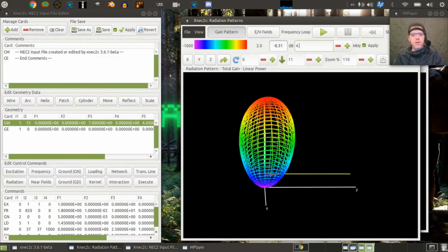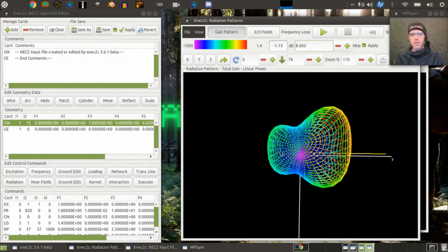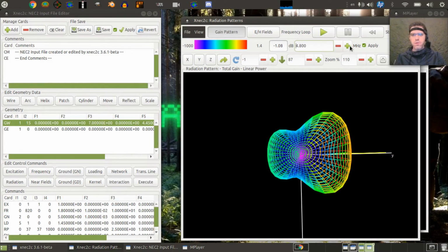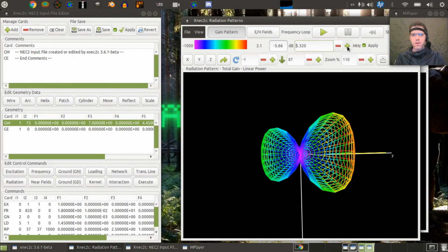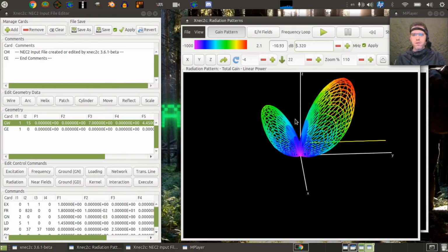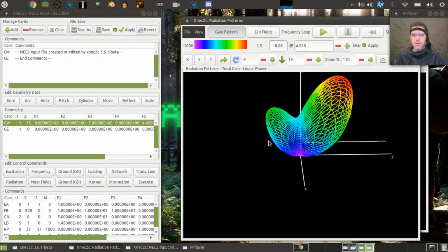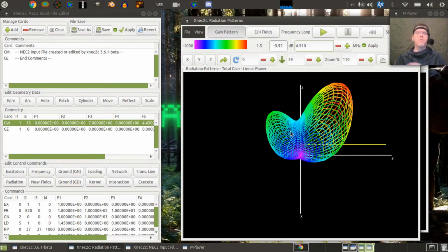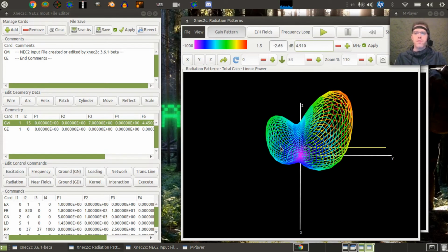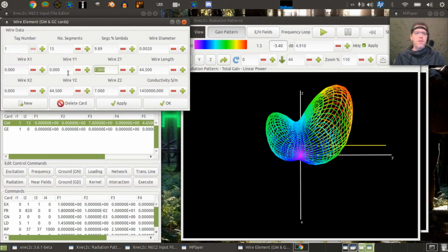So then we can even go further, and it's usable up to maybe 4.8. Well, actually, it would be usable even further. Well, it would be usable on the 60-meter band, or maybe not really, depends. Well, almost 5 megahertz anyway. Maybe not the 60-meter band, that it drops off even more there. But then it's elevated 7 meters, and you probably don't do that.